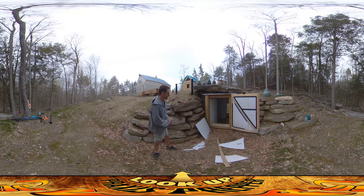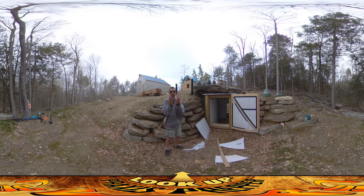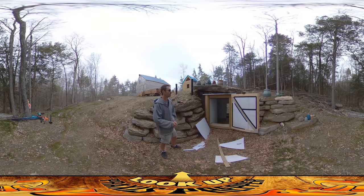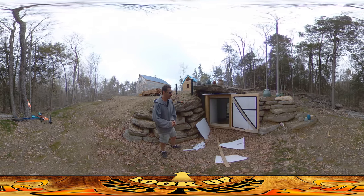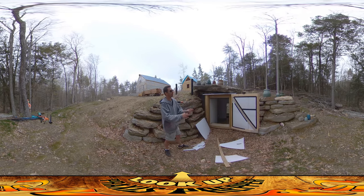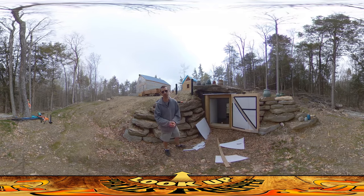So I figured I'd do this — I'm working on the root cellar door. It had a lot of pretty big gaps between the boards, because I put them on wet, then they dried, and now there's little gaps in between them, which is kind of normal. That's what happened with the floorboards inside, and it's what happened with the boards on this as well. So I'm insulating the door. I was going to insulate it anyway, but this will also act as a barrier so the air is not just blowing right through the cracks.